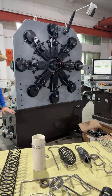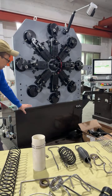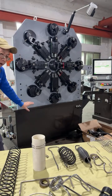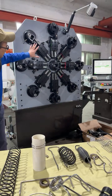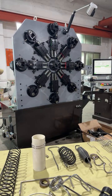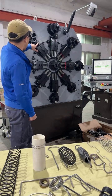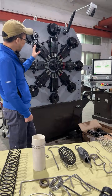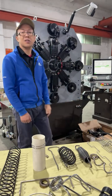Also the chassis, with the electric parts lined inside, like the control system mainboard, transformer, switches, and the servos for all 11 axes. We also have the probe, an air pump, and the lubrication. So this is the general idea of this machine: camless 10 or 11 axis. It has a spinner, so it goes to 11 axis.